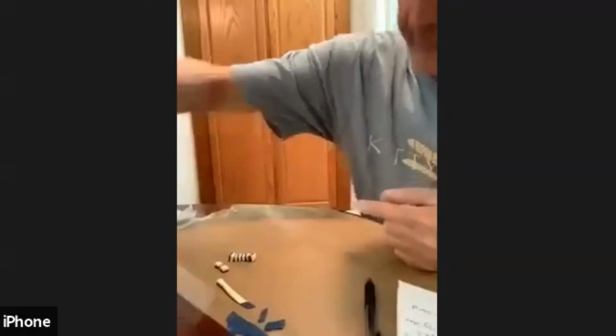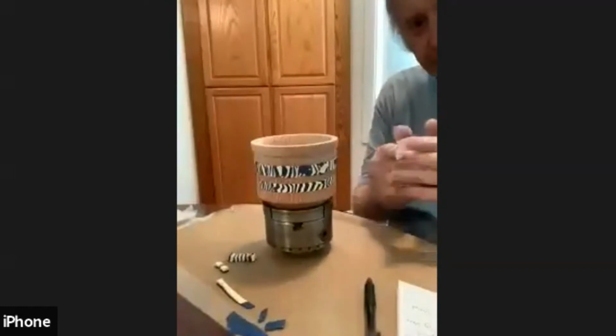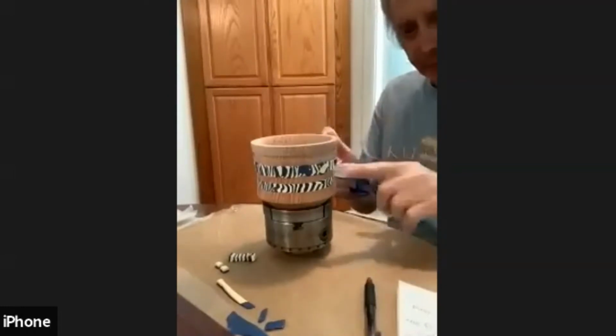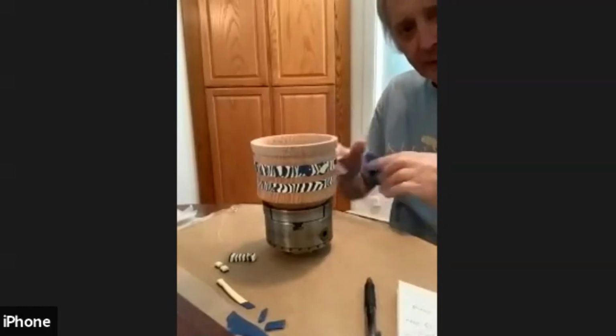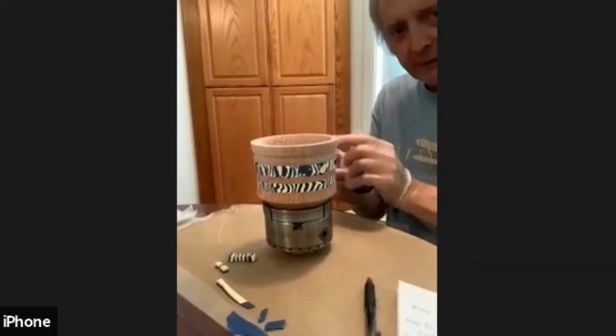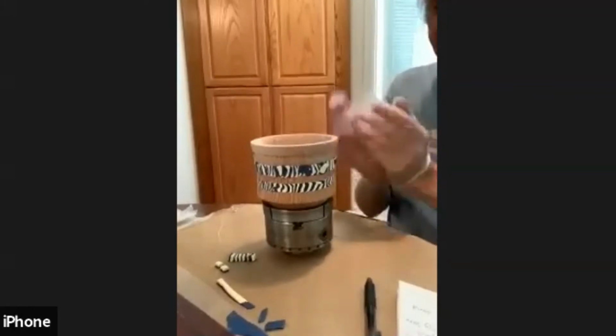While I'm doing this, I can show you a piece I made that had 3 grooves in it. The top groove I left open because I'll fill that now. This groove here is the Milliput that I pushed in, but it's not turned down. The bottom one is turned down and smooth. The top one is bulging out, and the bottom is nice and flush. Also, the groove is undercut a little bit so that it doesn't fall out, but I've never had any issue, even with very thin stuff.